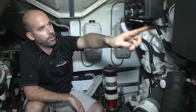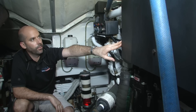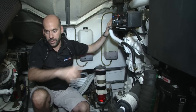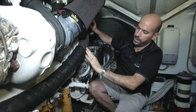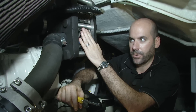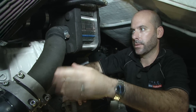It will then travel up and go through the charge air cooler, which cools the incoming air with seawater. It will then pass through to the heat exchanger which is on the front of the engine, then go to the other side of the engine where it would come out and go overboard into the exhaust system. You can see here this is the heat exchanger — we're on the other side of the engine now — and this is where it's going to come out and go into the exhaust system.